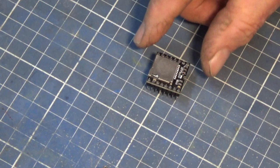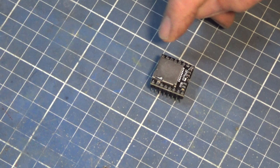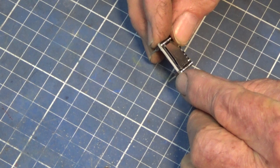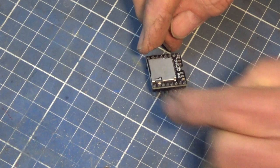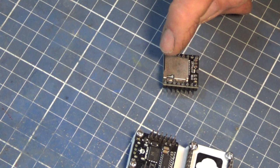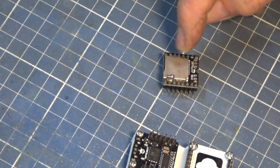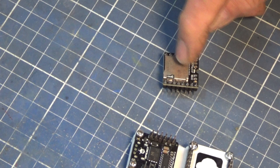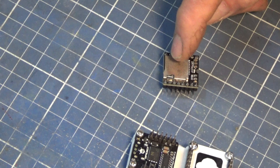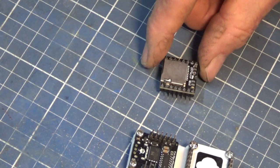The alternative was this little gadget called a DF Player. I bought four of them and killed one by wiring it up the wrong way. This one has no onboard storage — you have to put an SD card in. Although it does a similar job to the DF Robot device, this one does it really badly. When Mitch Markin and I were working on this project, he also bought two of these and tried and failed to make them work. The problems: horrible clicking sound on power-up, it clipped some sound files, and it wouldn't work with serial communication to the NodeMCU. I could never really get it to do the job. The DF Robot one, on the other hand — fantastic, no regrets at all.